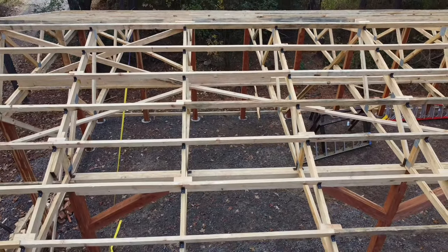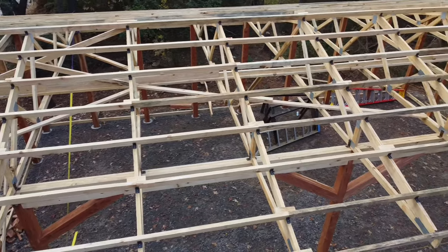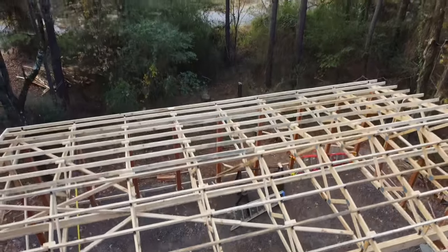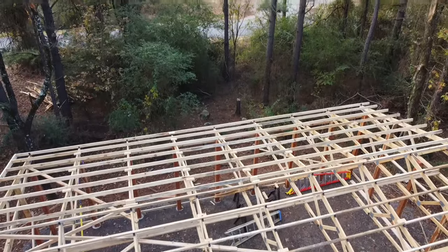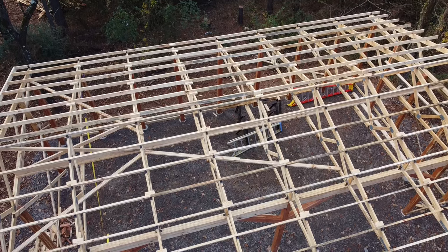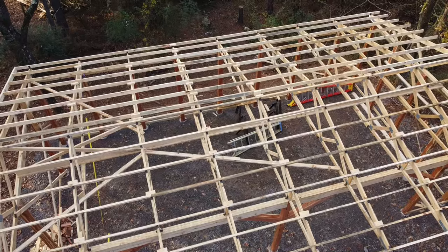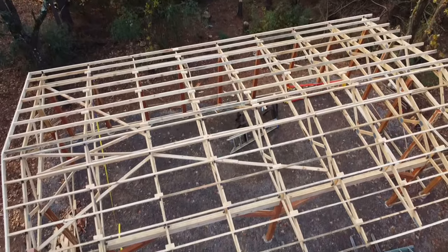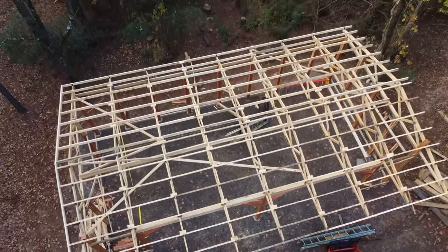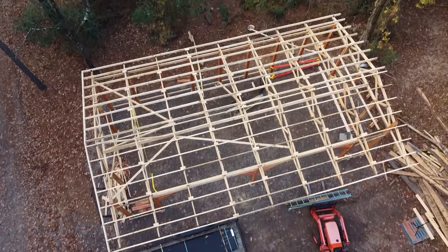We spent 2 days putting up all the lathing and the fly rafters on one end. It's a pretty slow ordeal. The lowest board is 11 feet off the ground, and the highest board is 16 feet. That's a lot of ladder work. Also, trimming all the boards to length, marking centers, and selecting boards that would hold my weight on 5-foot centers.